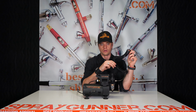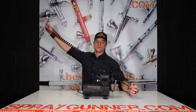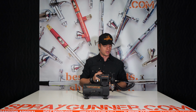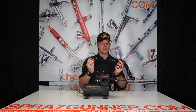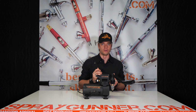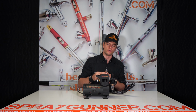First, you want to use this kind of hose. It's a coiled air hose, so even if you're close to the compressor, the real length of this hose is, well, you see I don't have the spread of my arms to pull it out, but all this length, and especially with this spring shape, it eliminates the pulsation a lot. It really helps.